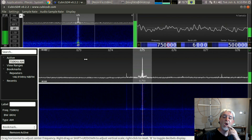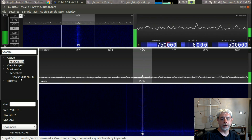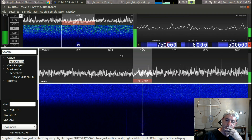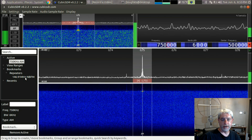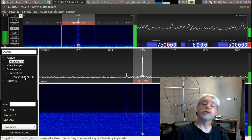And we can barely hear them but they're there. If I turn off the bias voltage they go away, so the amplifier is definitely working. I'll turn the bias voltage back on and there's our signal, not very strong at all but it's there. I suspect that if I built the power supply side and provided 12 volts we'd get a lot better result. I might be able to adjust the biasing resistors on the amplifier transistor - it's probably just not reaching a high enough voltage on the base to really do its job.